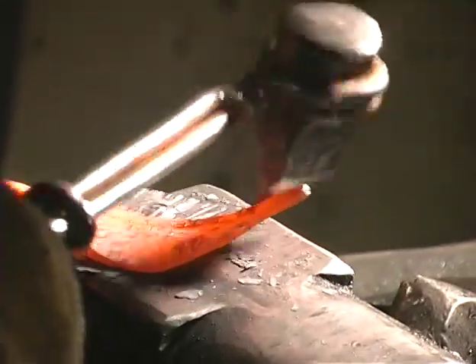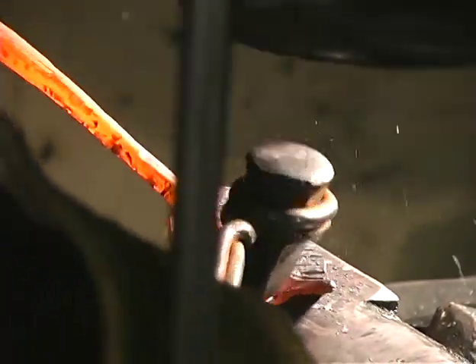Timing can be affected by almost anything that's wrong with a hammer. I've seen hammers that have been well rebuilt but work very badly. Friction anywhere in the hammer can alter timing, as well as anything that limits the stroke. Hammers with multiple problems tend to cycle in and out of time. You may get a hammer that strikes one good blow with the crank pin at 5 o'clock. The next blow is lighter and of shorter duration because the crank pin's now at 6 o'clock. The following blow may not occur at all because the hammer tries to strike while the crank pin is approaching 7 o'clock — the ram gets yanked back up before the die strikes the work. It's so badly out of sync that it shudders or gallops a beat or two, then gets back into sync. Bang, tap, miss. Bang, tap, miss.